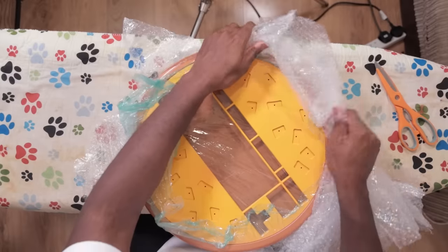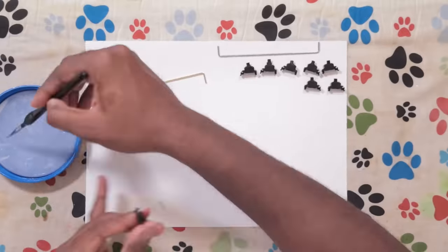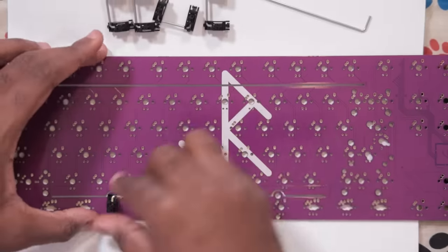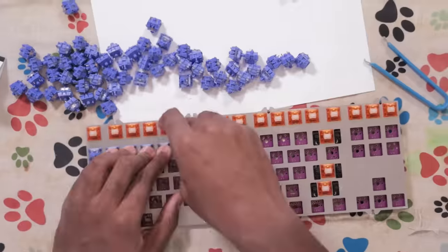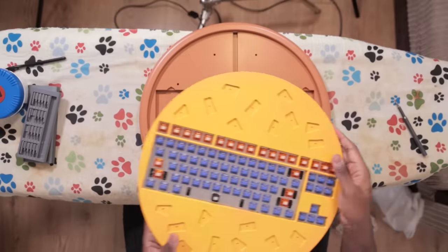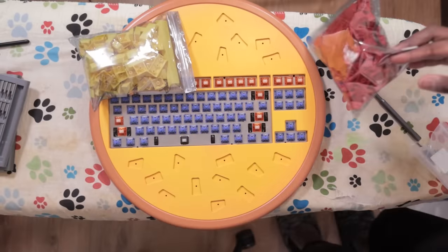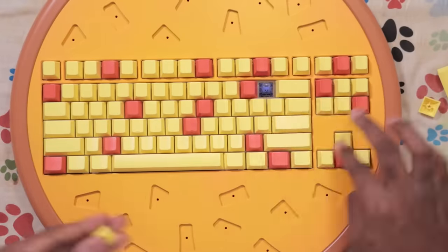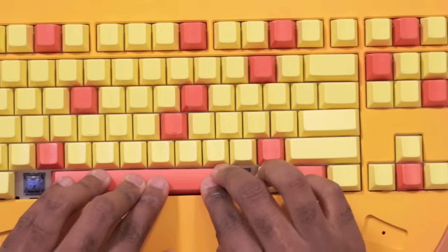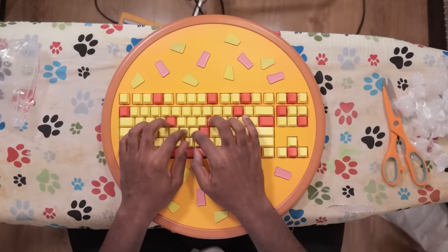Bon appétit! Welcome back to Binging with Gluttony with Glasses. Today we're cooking the world's first pineapple pizza keyboard. Every good pizza starts with the dough, which we've carved out of the finest Italian aluminium. Season your stabilizers with about two grams of Krytox 205g0 — let the plastic housings and grease get to know each other. Take about 90 switches and mount them into your plate, then apply a generous topping of solder wire to the switch pins, making sure not to overcook any joints. Once you've screwed your plate into your cheesy top case, carefully mount your daughterboard into the base and connect it via JST to the main PCB. Mount your keycaps in a random fashion — constantly second-guessing which combination of red and yellow looks best. Top it all off with a sprinkling of pineapple and ham, and look at that — a pineapple keyboard pizza. What pizza is truly finished without seeking the opinion of your diminishing Italian audience?